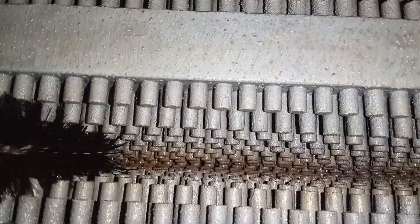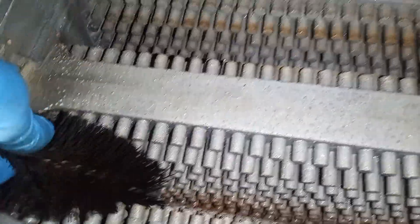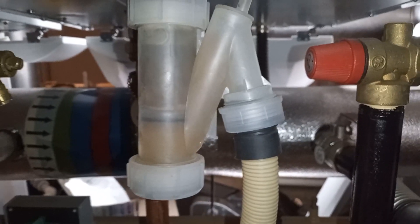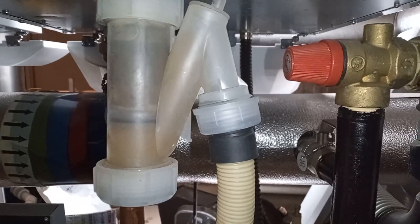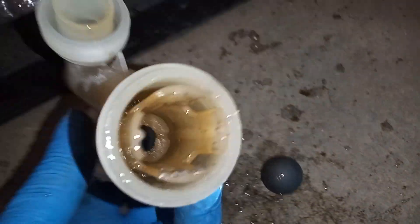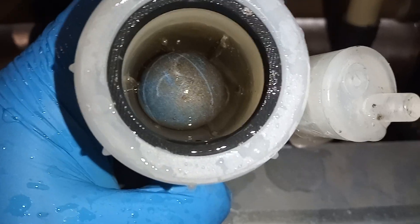Still cleaning away. Just running a couple of liters of water through the condensate. I'm going to give it one more rinse - that's the water coming from the other end. Now I'm going to clean out the condensate trap just in case it's been bunged up with any muck, then replenish the water after cleaning it. I gave my mesh a nice clean through as well.